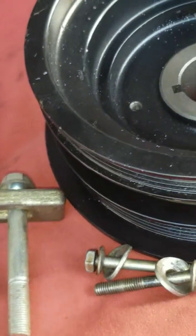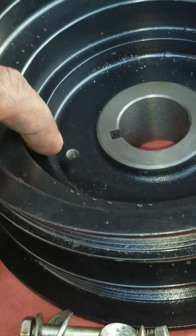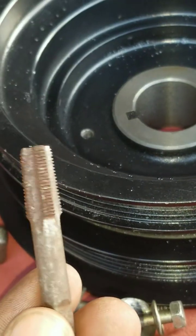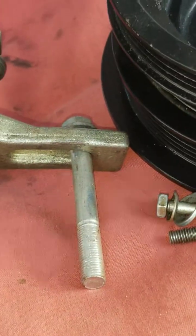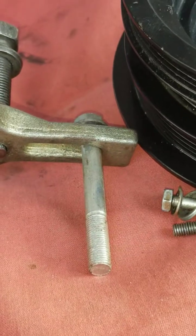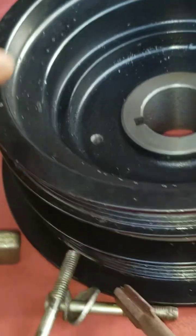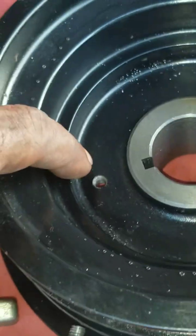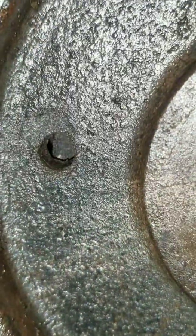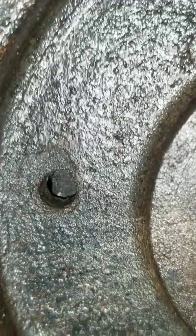What's going to need to be done is you're going to have to use a larger bolt and tap that hole that has the busted thread with a new tap cutter, so you can fit a larger bolt into that hole with the pulley tool. You don't have to go with a large bolt — you could go to the next size up by using a thread cutter to fit into that hole. You don't want to drill the hole out; you just want to tap it to cut a new thread into that hole.